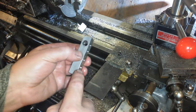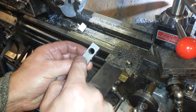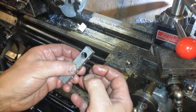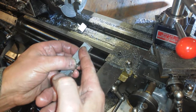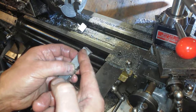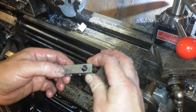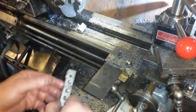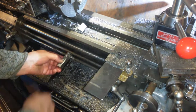Then I will slit it down to about where my thumb is, straight down there, split it open. Then I will slit it up to it so I'll have a piece missing out of it. Then I shall make some sort of brass shim washer flexure arrangement here on these 2 M4s, bolt it back together on the M4s, and then make an M8 lever a bit like this, so I can dismantle it, put it round, get it on, and then just lock it like that.